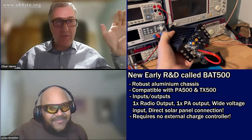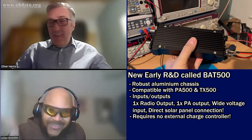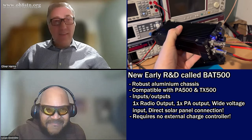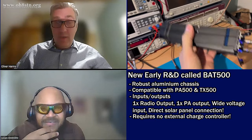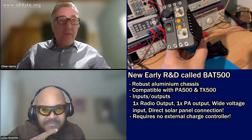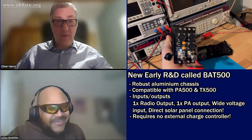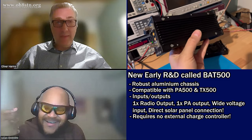Wait — so I can just plug in any of the Power Film panels I have directly into that battery pack without a charge controller? Well, yes — you can put any Power Film solar panel delivering 18 volts, 16 or even 14 is also okay. The unregulated solar module can be directly connected because it has a built-in charging module inside the battery pack. You've just removed one of the components — and saved weight and space. To have everything in one hand, that is my dream.